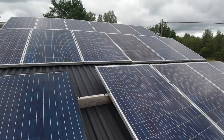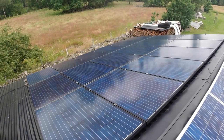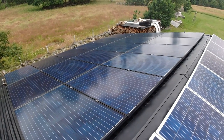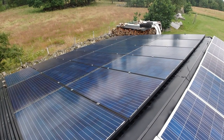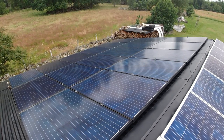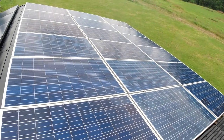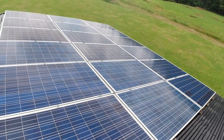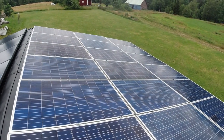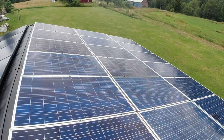On this side we have even more poly panels at 265 watts, split among the two PCM60X chargers, and they work great. Not long ago I actually cleaned them up as well. The second channel on the MPI is the bank here with 18 panels — no problems there either. I've cross-checked all the fittings and mountings I made myself and they still work really really well.